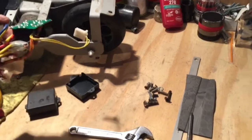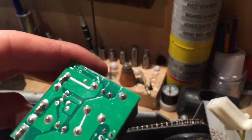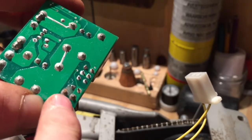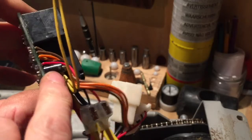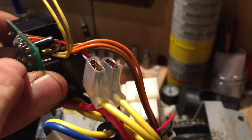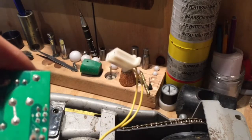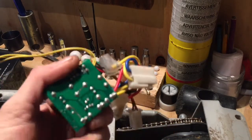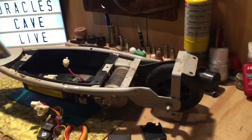Let's see what that's for. Oh right there — see the charring, see how that pin's blackened. There's loads of dust all over the board. This black thing — a diode or resistor or whatever it is — that's bad. So it probably needs a new one of those. It's probably at least 20, 30 bucks right there for that, and we don't even know if the batteries are good. If in doubt, rip it out.